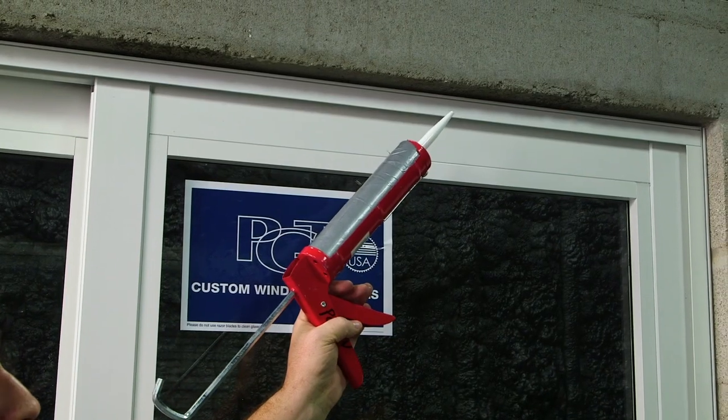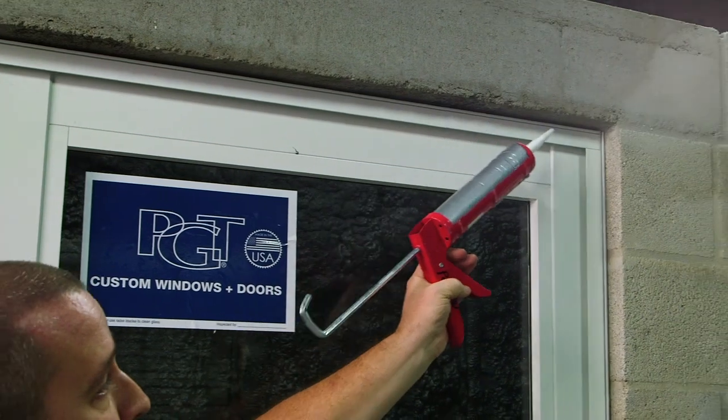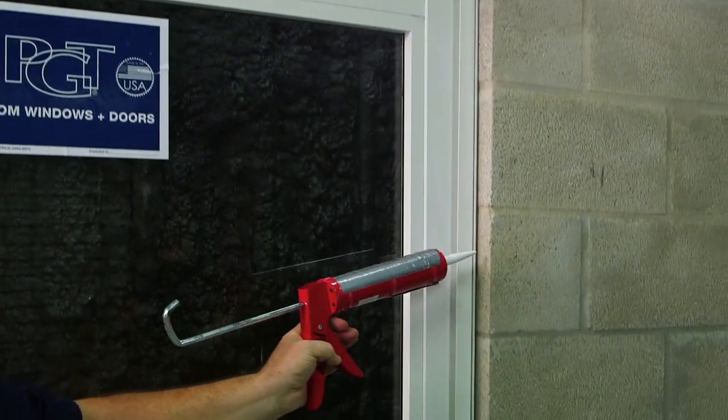Once installation is complete, apply a continuous bead of sealant to the outer perimeter of the mainframe. So to recap, in this video, we installed our sliding glass door mainframe. We set the panels, we added the handles, and adjusted keepers as needed. In the next video, we'll make the final adjustments to the door.